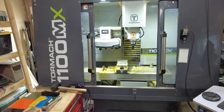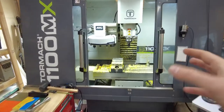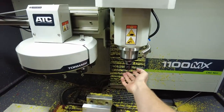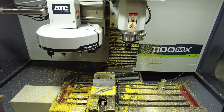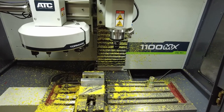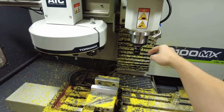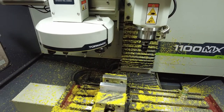The first thing I'm going to go over is how the coolant system in these machines actually works. The purpose of coolant in a machine like this is obviously to cool the tool surface as it cuts on any material, but also to evacuate chips. You could arguably say that evacuating chips is the main reason for the coolant with a lot of materials. You have these jets that spray at the tool — that's why these big enclosures are on these machines.